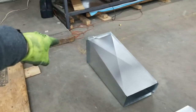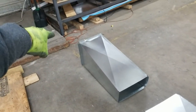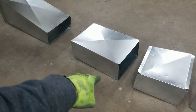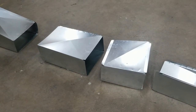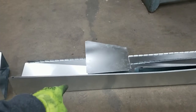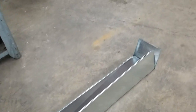I got measurements and I've been back at the shop making ductwork for a few hours and I'll show you what I've got. First is a piece to transfer from a 12 by 16 to an 8 by 14 that will go on the unit end right there, and then this will be a short piece of ductwork through the block wall, then we'll offset up about an inch and a half to be high and tight to the floor joists above. We'll run some 8 by 14 and then reduce down to 8 by 10.